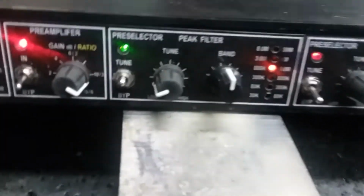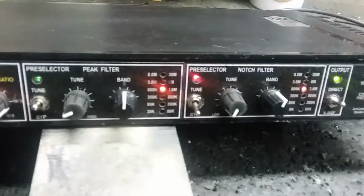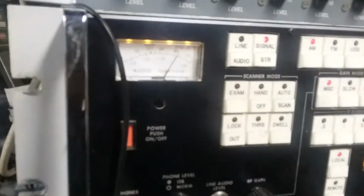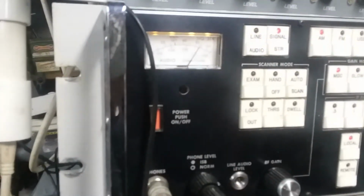All right, let's do the peaking thing, which is on right now. Actually, that's probably why we weren't. Oh, I'm sitting on the peak. Sorry. All right. We go back to the attenuator. There we go. And I'll bring it to full scale. See, without a rehearsal, this is what happens. And turn the attenuator down. See? Before I was fighting the peak thing, which is giving me like 40 or 48 dB of gain, so no wonder this thing didn't want to work.